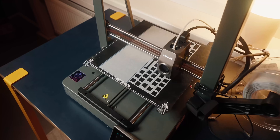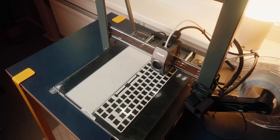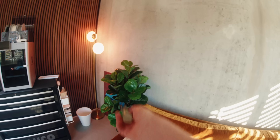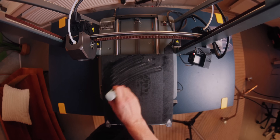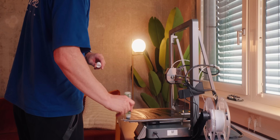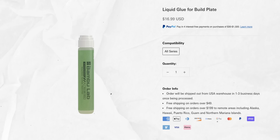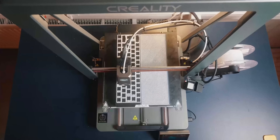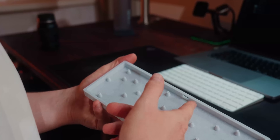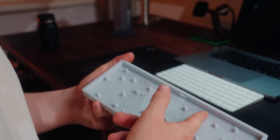If you're having problems with your print either not sticking enough or sticking too much, then a glue stick, liquid glue, or something like hairspray or 3D lac is gonna be a big problem solver. Especially on big, large and flat prints it's really helped my success rate go way up and you're pretty much not having any warping at all. You don't need it with all prints but it's definitely worth knowing about.